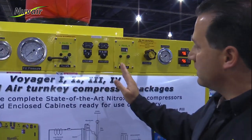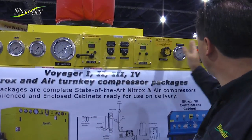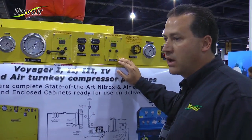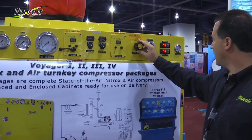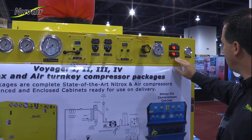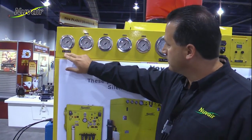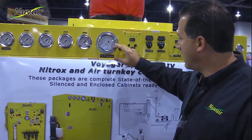The Voyager 2, 3, and 4 is divided up into two sections: your high pressure compressor from here over, and your low pressure compressor from the center to the left. Your control for turning on the high pressure is here, and your low pressure here. Your permeate O2 will be calibrated by turning on your high pressure compressor. You'll adjust your O2 percentage up to 40% with this knob. Your LP pressure will come up after about a minute and a half of run time. Your cabinet temperature and heater temperature refer to the heater temperature on the membrane. Your oil temperature refers to your rotary screw oil temperature. Your oil pressure for your high pressure is here — first stage, second stage, third stage, and final stage on your high pressure compressor — and your fill pressure.